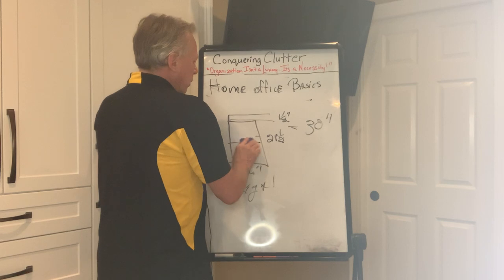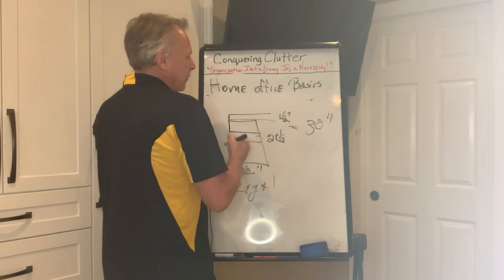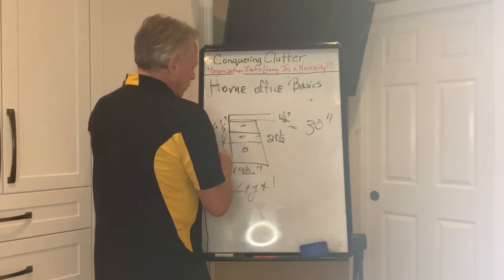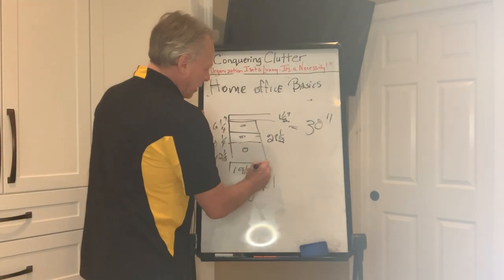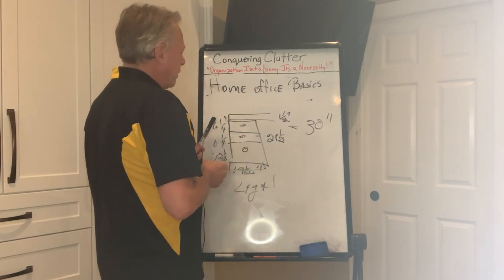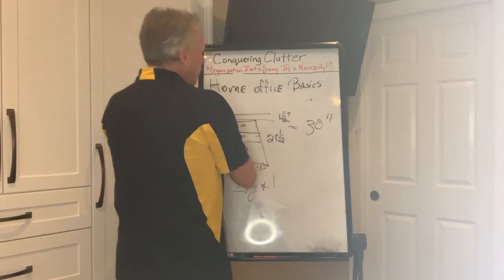You can have one file cabinet on the left and one on the right. You could add a double on the left, and on the right do a utility drawer configuration where drawers are 6 and a quarter inches tall each, with the last one at 12 and a half — that's the height to get you to 28 and a half inches. There's usually a toe kick on the bottom so the drawer isn't sitting directly on the carpeting or flooring. So remember: 6 and a quarter, 6 and a quarter, 12 and a half — or two 12 and a halves if you want double files.